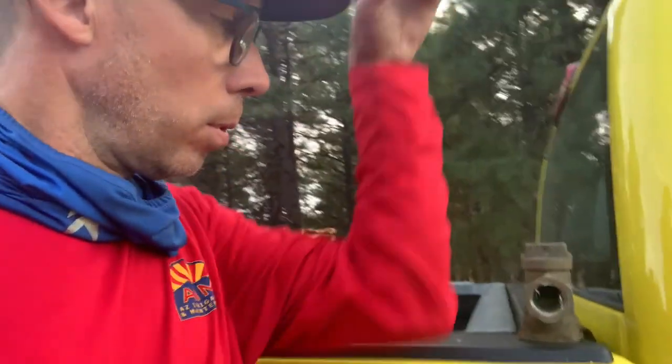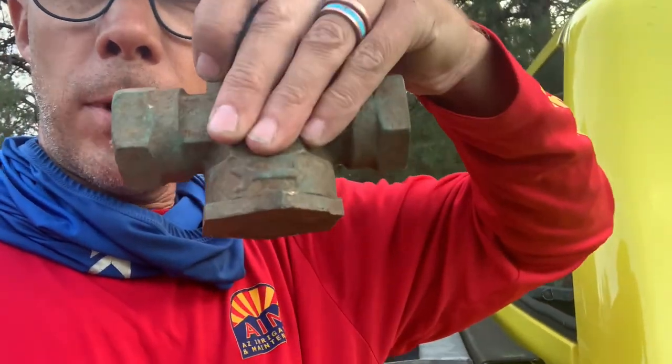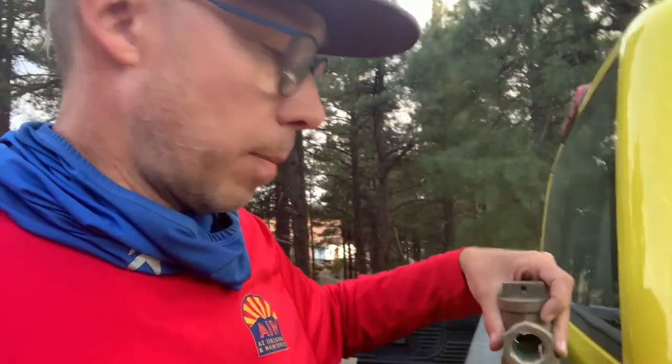The other failure mode is when it's actually leaking through as it flows through the valve — basically the valve doesn't shut off. It's flowing through the valve like when a heart valve fails; the water, like blood, is still going through there.